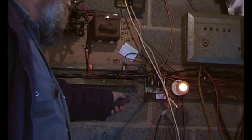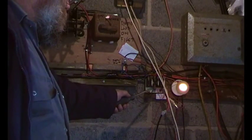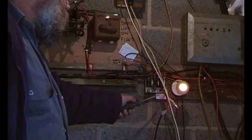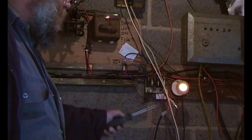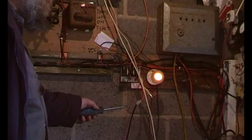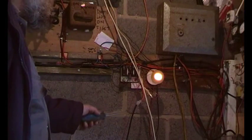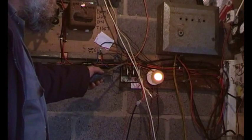Then what we've got here is a little fuse board. I think it's out of a milk float actually. So this one here is the 12 volts from the battery. This is the slave battery, which is just down there. It's a standard 12 volt battery. I suppose we better have a look at it really. There's the slave battery. So the slave battery runs the tracking motors. We've also got 50 volts here through a fuse, and that will go off to the charge controller.